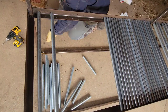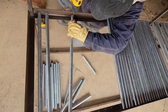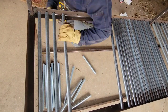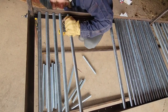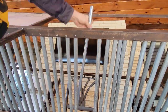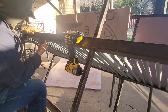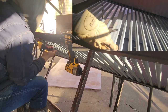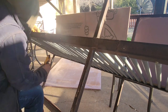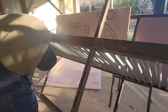I don't think I should have trouble if it has the right moisture level. To get through the angle iron I had to drill pilot holes; otherwise I was snapping the heads off of the self-tapping screws I was using to attach the conduit. Another way to secure the conduit might be to just get a piece of wood to rest on top of the angle iron and drill the right diameter holes to match your conduit, whether it's half inch or three-quarter inch. This was probably the most time-intensive single step — tedious measuring and drilling each hole, with quite a few self-tapping screws breaking in the process.